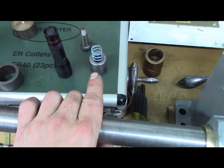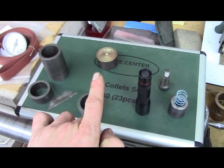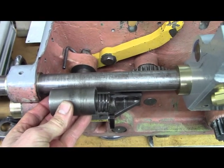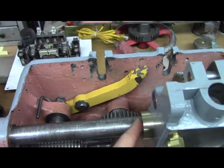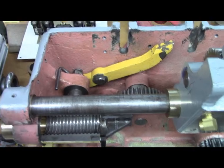So like I say, two things. Modify that detent plunger, or actually not modify, but make it out of aluminum bronze. And these are the spacers. I got to set them up on this power feed shaft. So when the handle's aligned with that slot, this thing is spaced over, and it kind of sets the distance for you to drop in the slot.